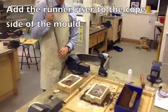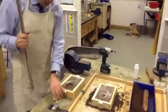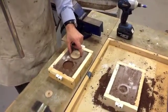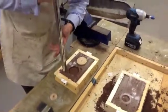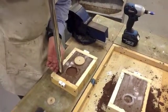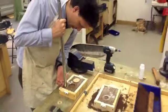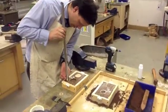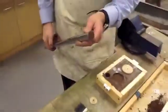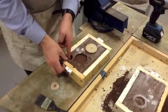All I'm going to do is push this tube into the sand — the idea is to remove a column of sand. If I had two designs, one here and one here, I'd create my runner in this corner. I'm really carefully going to push the tube into the sand very slowly, then carefully pull it out. That's removed a core of sand, and I can now firm this up using my finger and thumb.